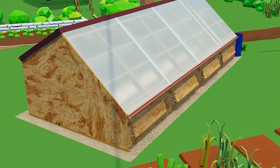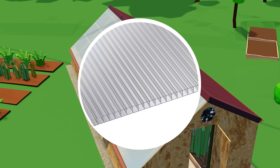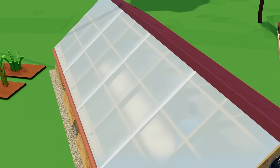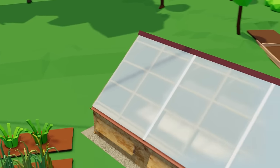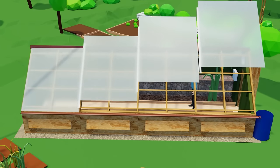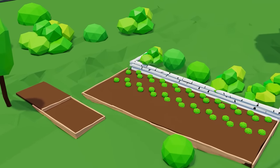Glazing. When it comes to greenhouse glazing there are several options, but the two main options are glass or polycarbonate. Polythene is also an option but since we are trying to retain heat it will not be considered here. For me the choice is clear — excuse the pun — it's polycarbonate. It may not be the cheapest option but its benefits outweigh this drawback. Polycarbonate is significantly lighter and easier to handle than glass, and much more difficult to break. Many people opt for double-skinned polycarbonate, which has a small air gap that provides better insulation. A lesser-known property of polycarbonate is its ability to diffuse light, meaning that no matter what direction the light hits the glazing it will be diffused into the greenhouse, making the angle of the glazing less important. We still need to consider snow shedding, though it may not be a concern for everyone.